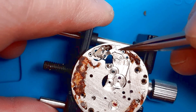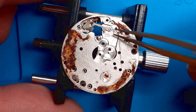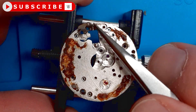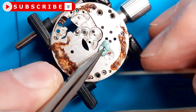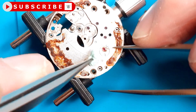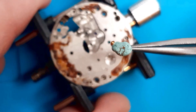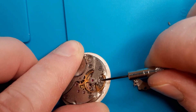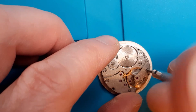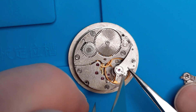The screw here is damaged — also the screw. The construction is very, very similar. The only difference is that the Seagull is bigger. This movement has a 26mm diameter and the Seagull S36 is one centimeter more. Okay, so now I will have to prepare — I think I will take the hairspring from this wheel. These movements look a little bit different but actually in construction are the same, I hope.